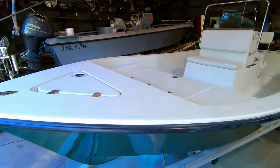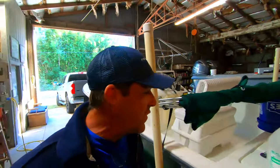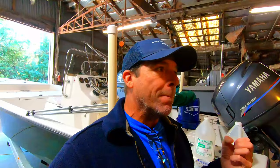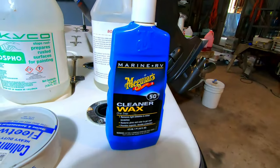It really freshened up our little Buskins 19 — this is a really cool little boat, great for inshore fishing, an all-composite boat that runs really well with the 115. Now, something really important after you do a hull cleaner or acid wash on your gel coat: it's going to be really clean, but it's going to be open and porous. If you put the boat right back in service, there's a high likelihood the first stain, fish guts, or blood is going to stain it again. So if you've got light oxidation, a Meguiar's cleaner wax would probably be a good bet.